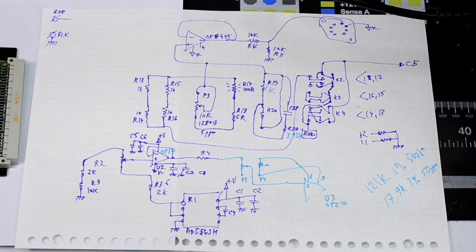So essentially what we'll do is desolder those resistors first, measure them, and see if they are in the ballpark of the correct value. I think they are, because I did some quick tests with the bodged parts, and it looked like it's working again. But that's a little bit of a teaser already, so let's go step by step.